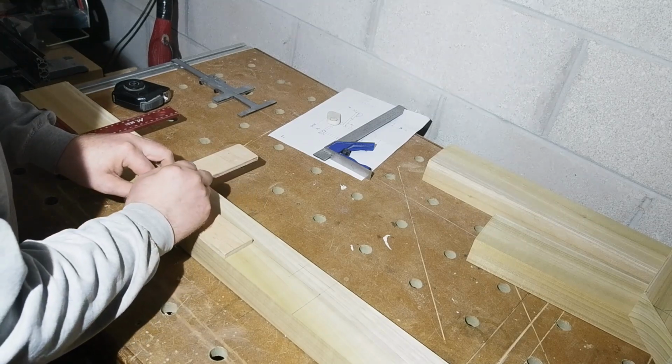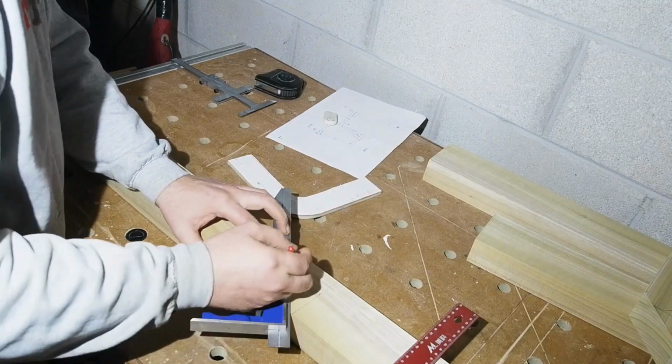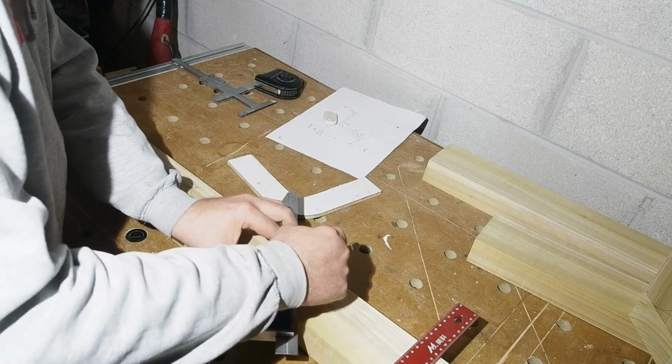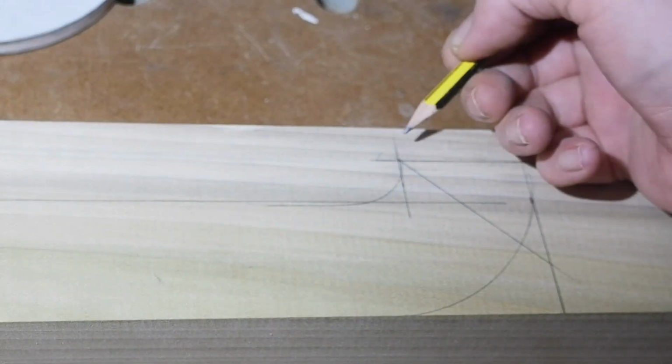by matching it up. What I've laid out here is what you might call the top rail or apron rail, laid out in the centre of a piece, with enough either side to grain match its adjoining legs. The joints will be mitered and loose tenoned. The important marks at this stage are the outside edge and the crossover that gives me the mitre position.